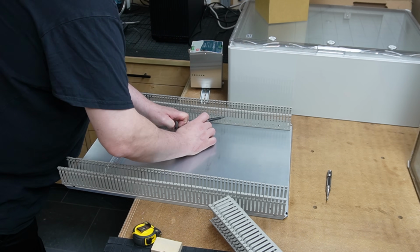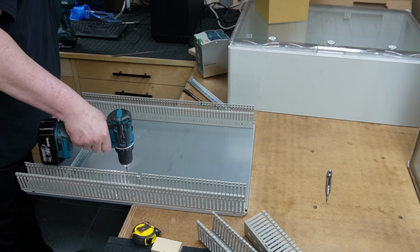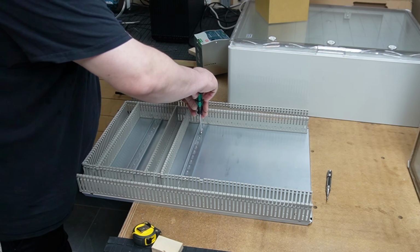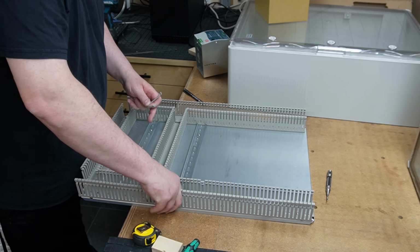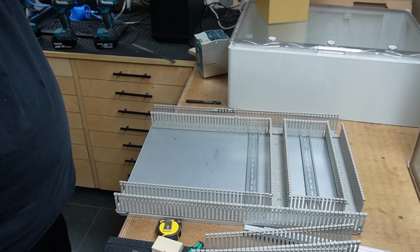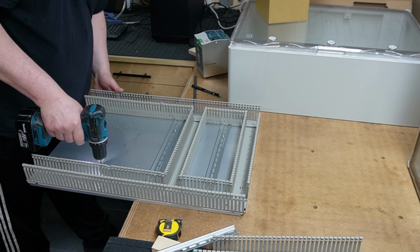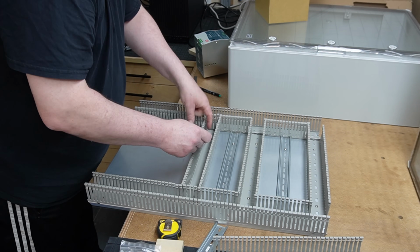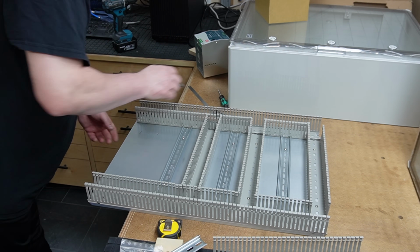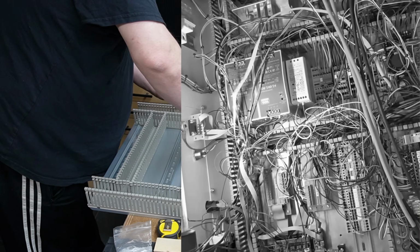used. The first task is to mark, drill and tap all the holes to fix the 35mm DIN rails and the cable ducts. Almost every controller cabinet comes with a mounting plate out of 1.5mm thick zinc-coated steel. This holds not only the components, but provides as well a common ground to all the DIN rails on the plate. So in case you build your own cabinet, even if it is out of wood, make sure that you have such a metal plate as a basis for the parts and do not bolt the rails directly to the wood. I use DIN rails and ducts simply because it looks cleaner and makes the whole process more professional, rather than having a zillion cables flying wildly around in the cabinet.